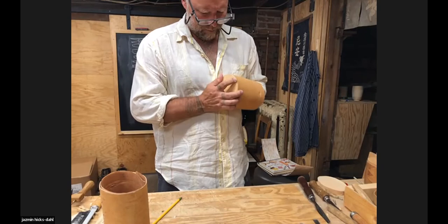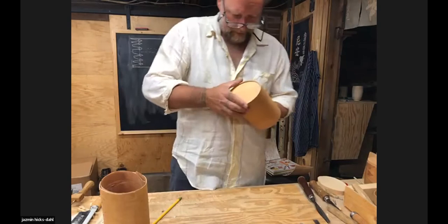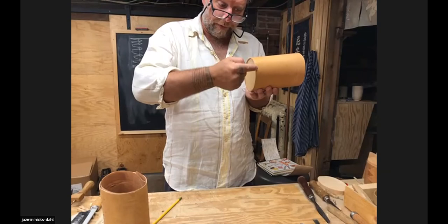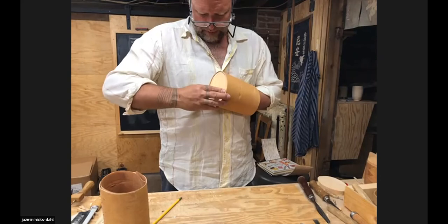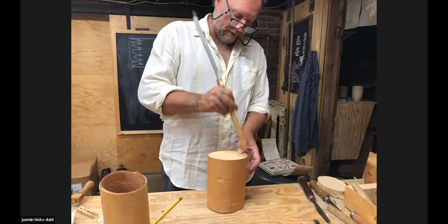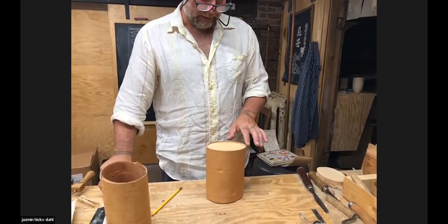Someone's asking if that bottom piece should be 90 degrees and not tapered. 90 degrees, yes. And what you can do to facilitate the fit is just chamfer the inside of one of the corners, that last one that you put in. But otherwise, it should be tight. You have to hammer it. And what Ramon suggested too is to have it inset just a little bit. There's a little lip here.